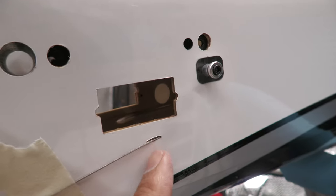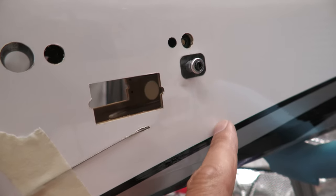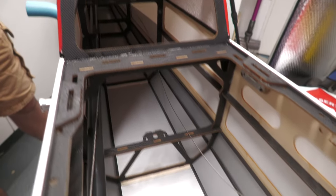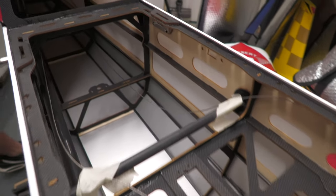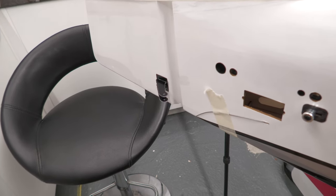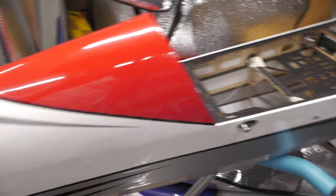While the horns were drying, I ran the closed loop wire — the holes were already opened up, and on the other side of the holes there's a nice piece of tubing that stops at the former. If you thread the closed loop in from the rear, you can hook it through the fuselage. The next step is connecting the rear of the closed loop, putting the ball joints on both sides, and then finding and installing the rudder servo to finish off the closed loop.